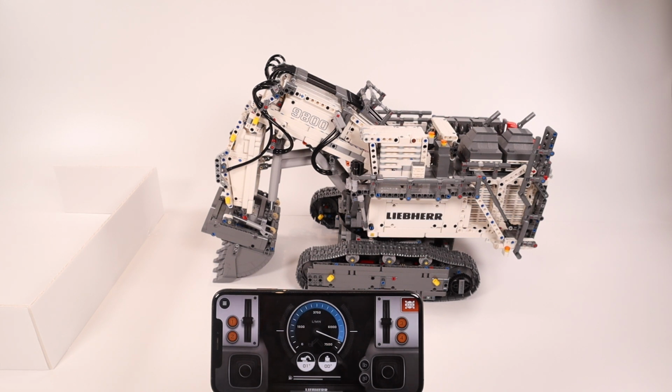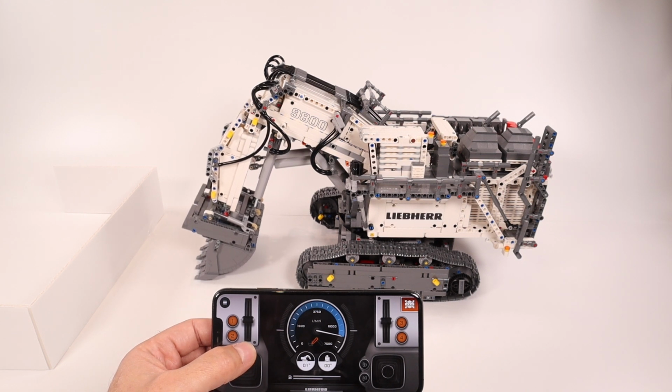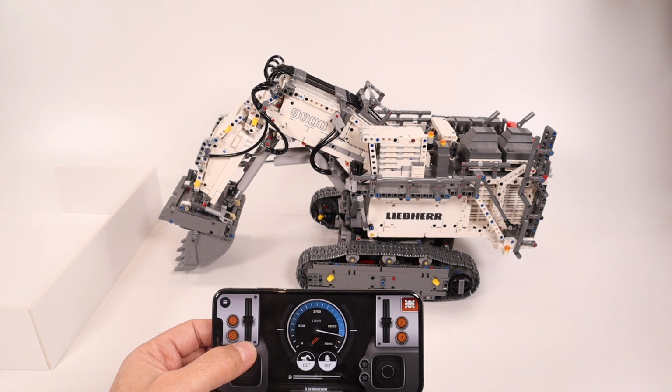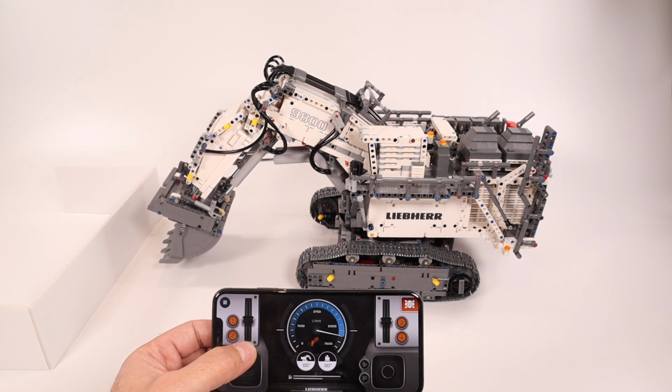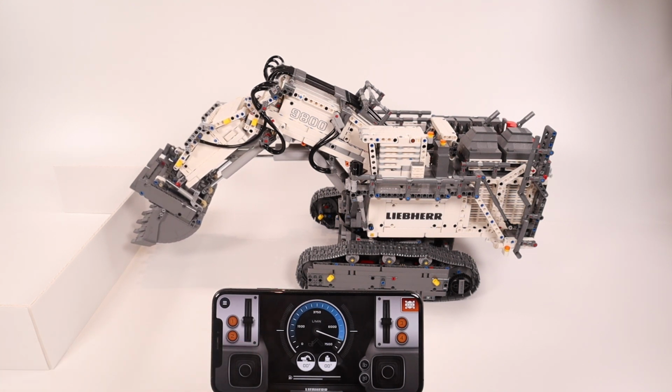So from here, most of the scooping and scraping is going to be done with the lift arm. That's the left control up. And so let's see what happens when we push that forward. You see it's going forward. The bucket has been kept parallel to its original position. That's not tipping at all until it gets to a further extension. Problem is though, it's already way off the ground. And if we want to keep it low that whole time, or even touching the ground, scraping along the ground, then that's not very helpful.